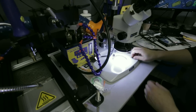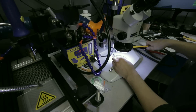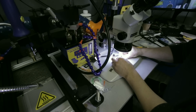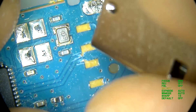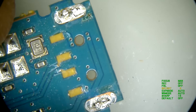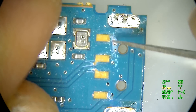We need to basically attach individual pins — individual headers of this connector — to where they were supposed to originally go. But the problem is that the pads that were supposed to be accommodating these headers are no longer in place. So how can we go about this situation? We can either clean up some partial areas right on the leads, or we can actually solder them directly to where they're supposed to go. I'm just gonna brush up the leads a little bit and wire the headers directly to them.